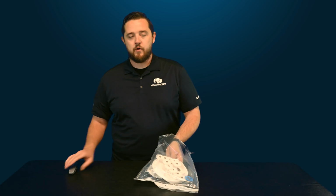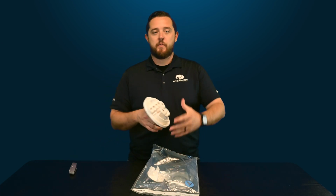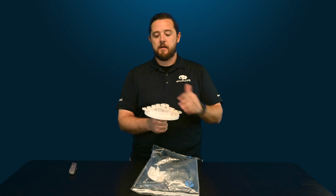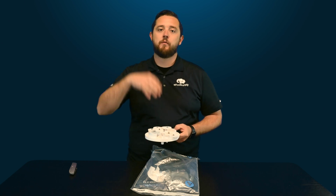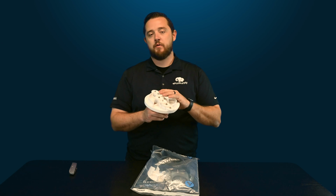So if you guys have seen any of our other videos where we go over any of the low profile valves, of course you always have the same style gear kit. What makes it a low profile gear kit is you don't have that traditional white PVC ring that sits on top. So it allows it to be a lot more low profile in the valve as the water is going to be coming in from the side. You're not having as much of the dome with the water coming in through the top. So they do slimline the actual gear kit itself.